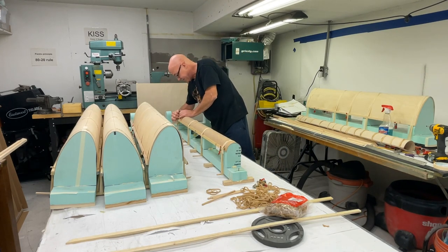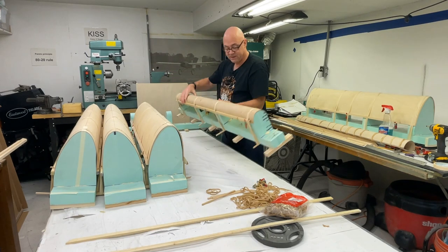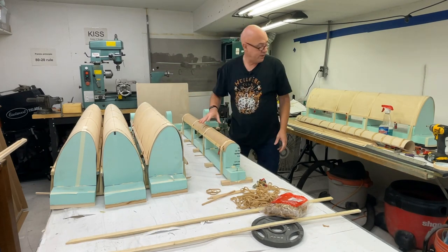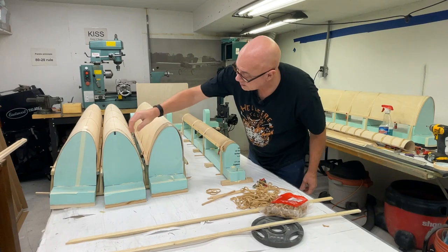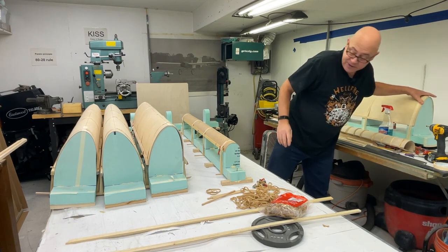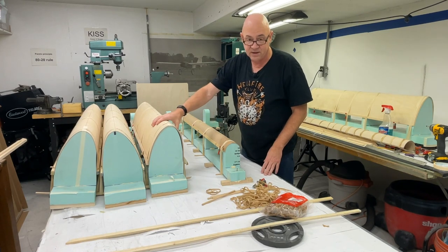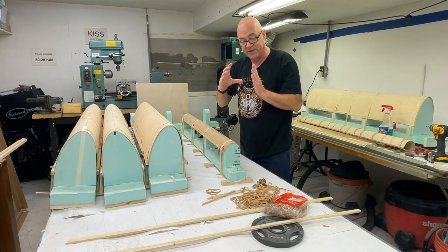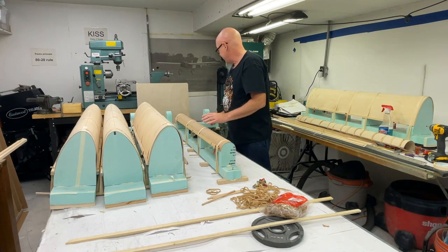That is the last of the leading edge skins I needed to curl. Let me double-check and make sure everything looks good — that's what it looks like when it's on the form. Now, one thing about these is there are four skins on this form right now, which is the reason it's bowing out a little bit. There's one skin on that side and one on that side, and two skins over here. As you're building these, I actually put a skin on top of a skin to keep the shape. The radius is changing a little bit, but when I went and test-fitted it on the leading edge of the airplane with the ribs, it didn't matter — it still pulls up nice and tight.